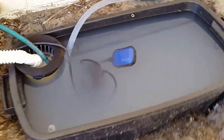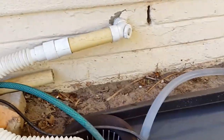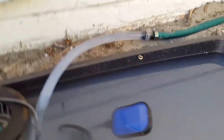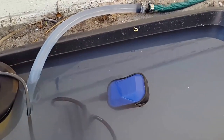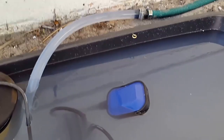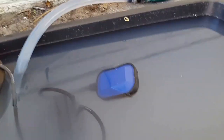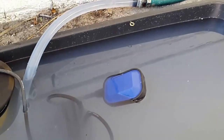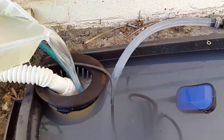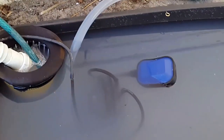As you can see, the tank is almost full. I'm going to add a little bit of water manually just so that you can see the pump going on. There's the float switch of the pump — as the water rises it switches on the pump, and as the water level drops again the float switch drops with it and switches the pump off. I'm going to add some water in there and hopefully it will switch on.